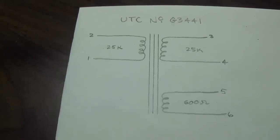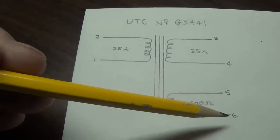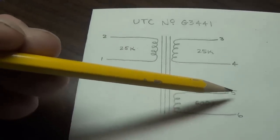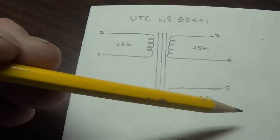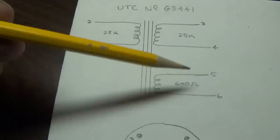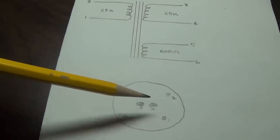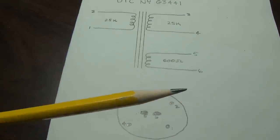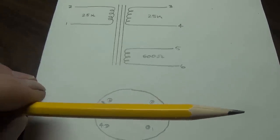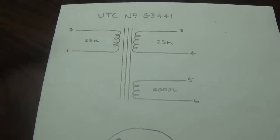It's just a guess, but it's the best I can do. It also explains why there's no original-looking wires connected to any sort of input. I think it was hardwired — a cable connected to those two points on the transformer passed through that grommet at the rear of the chassis, went down and coiled up in the bottom of the cabinet. When it came time to play your accordion, you uncoiled it and plugged the quarter-inch jack on the end into your accordion, where it would pick up the weak signal from the transducers within. That's my guess and I'm sticking to it.